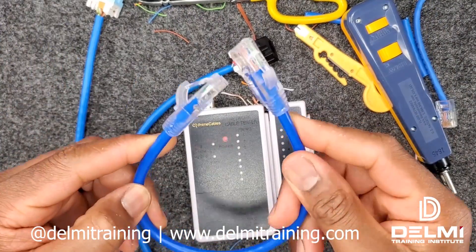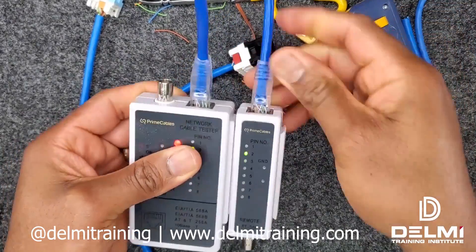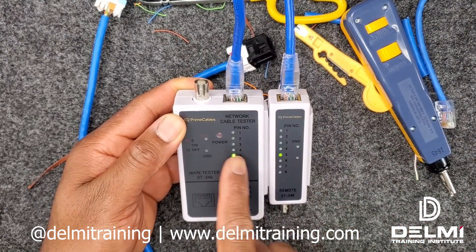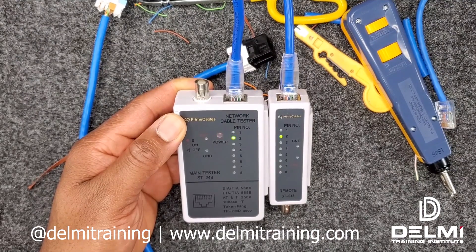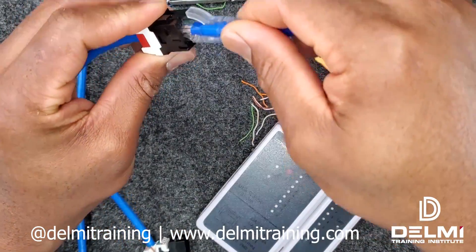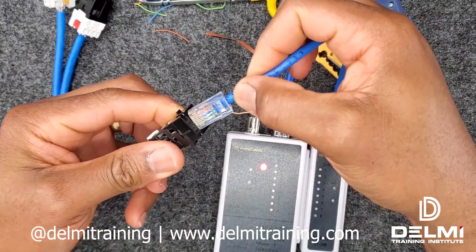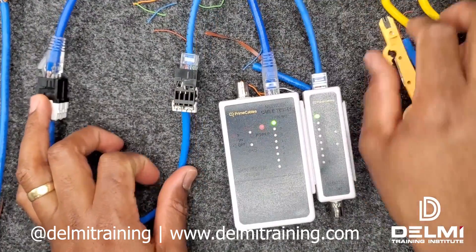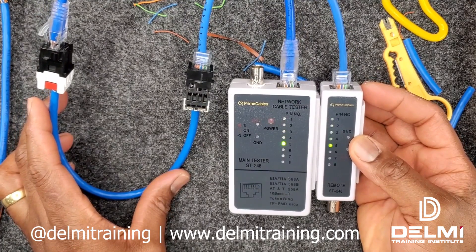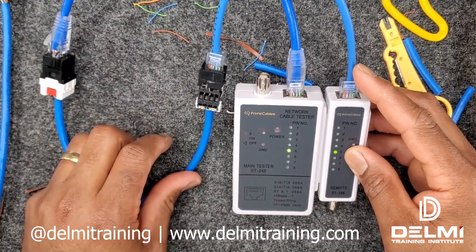Now this is a pre-made cable that I also purchased and I'm going to test that one out. I plug one end in and plug my other end in, and I just want to ensure that my cable pinouts are all straight through. Once I've confirmed that, I'm going to take one end of the cable and plug it into my terminator jack, and take the other end of that patch cord that I already made and plug it into the other end of my 5e jack. As you can see, the cables are going through the pinouts without issues, and that tells me my pinout configuration through the patch cable and through the jacks that I made are all working well.